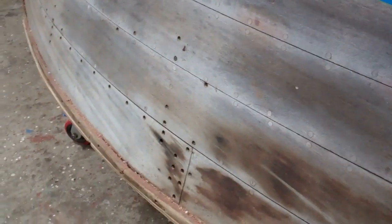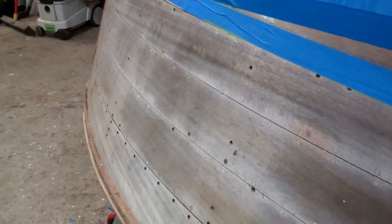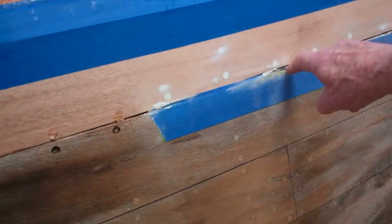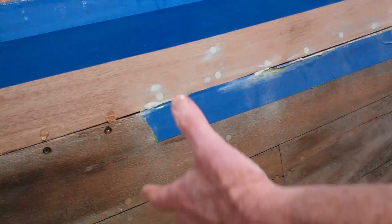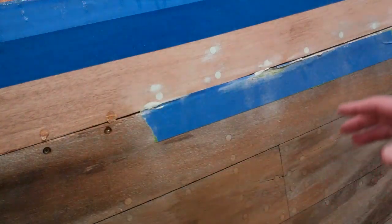are still in quite sorry condition, mostly cosmetically. But we have to remove every one of those fasteners. These planks have to be released. And you'll see that right now, because of how much this plank has shrunk over the years, we're faced with a real space. So when we do the top sides, or when the owner restores the top sides, if he chooses to take that on, these planks will be released, all of them, and then we'll restack them so that these seams are absolutely tight. We'll be able to repair any issues. And the last, or if you had the boat right side up, the top plank will likely refabricate a little bit wider so that it fits in there nice and snugly.